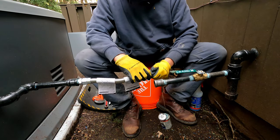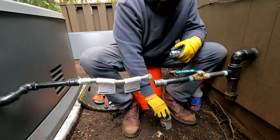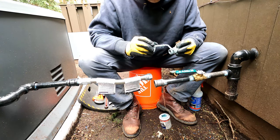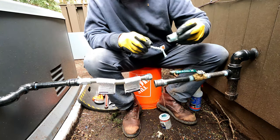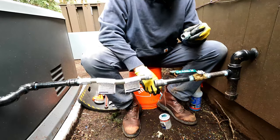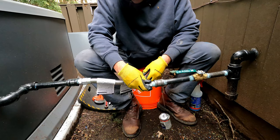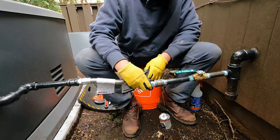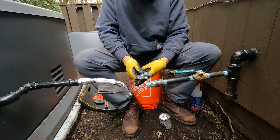Let's put a little bit of dope on the back end — never put it inside the pipe, just on the outside, in the fitting. You could do either the outside or the inside. It could be either half inch or three quarter, but you gotta make sure with the machine you're working on you can get enough BTUs of gas to your machine. Whenever it comes to these fittings, I prefer not to bite them up with tools that have teeth.